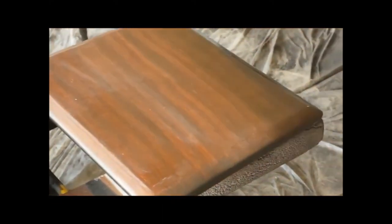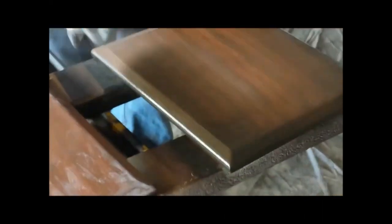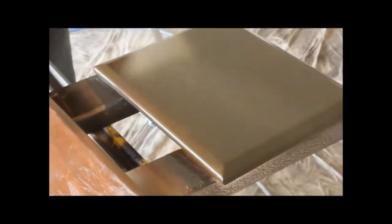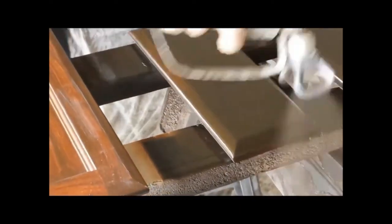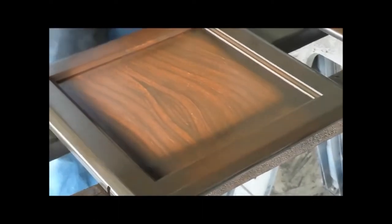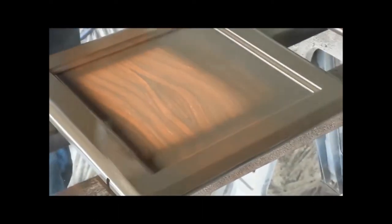You can see it's brown — not really black. After we clean up and do a light sanding on the doors, we apply several coats of this vinyl sealer. In this case there were two coats. You can see that ugly fake grain that was hand-painted onto the maple cabinets. We came back with this espresso color to cover it.